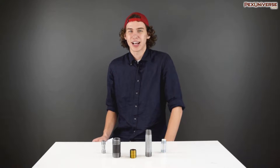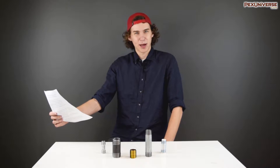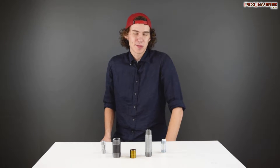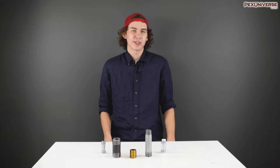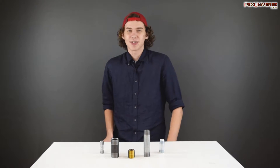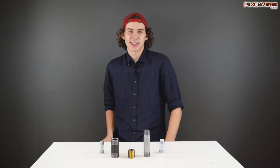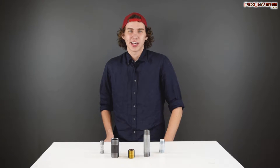Today we're talking about pipe nipples — the most bizarrely named and most common of plumbing products. Anyone who's installed pipes before probably knows all about them, but either way we're going to cover uses, materials, installation, and how to remove pipe nipples. A pipe nipple is simply a short piece of pipe with male threads at both ends, and its general purpose is to connect two female threaded fittings together.